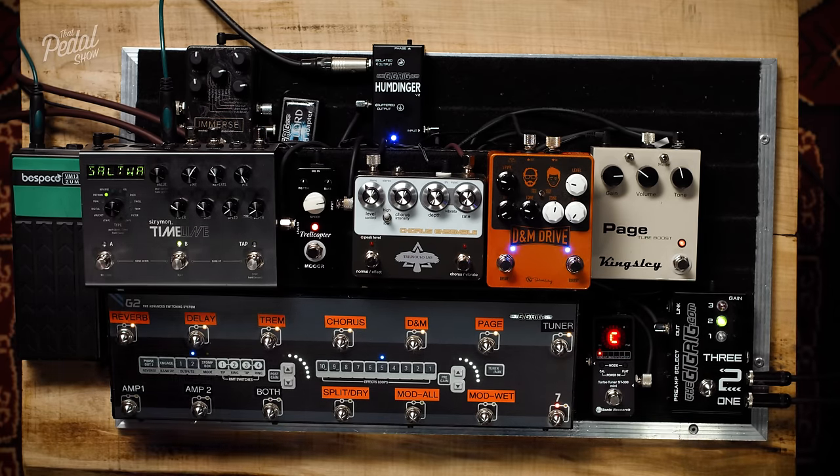If the amps are in phase, this is how the speakers are moving. Now, I'm going to be relatively out of phase with Mick. So here we go. What's happening here is as the cone of Mick's speaker is pushing forward, mine is pulling back. Now what happens is you get what we call phase cancellation.